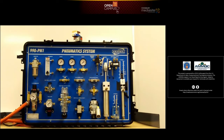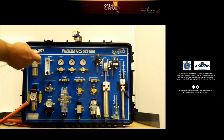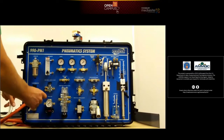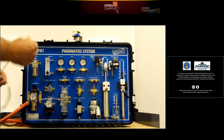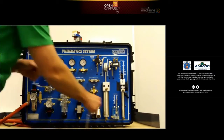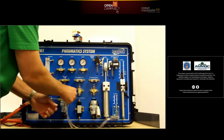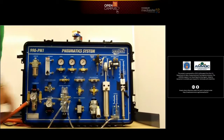The first thing we're going to set up is looking at the single-acting cylinder — this is the one right here. We're going to run it through a lever directional control valve so we can see how it works. We connect it to the power source here — the power source of the air is off. We'll put it to the inside of the directional control valve, connect one here, and then connect a longer hose to the actual cylinder, into the valve, and install another one here to act as a muffler or release of the air as the spring forces the air down.